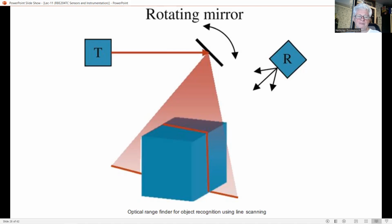Another applicable option is a set of mirrors through which the scanning plane, transmitted by a single source, is projected from the two sides onto the object. The same mirrors can be used to redirect the light from two sides to the common receiver. This solution is proposed in, for instance, a system in which the scanning is performed by an optical deflector. Evidently, the two scans should be complementary to build up a complete image of the object.